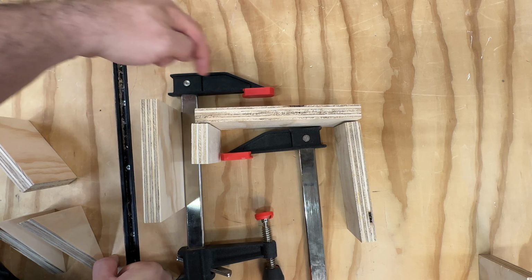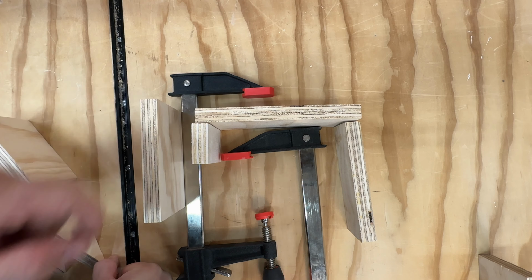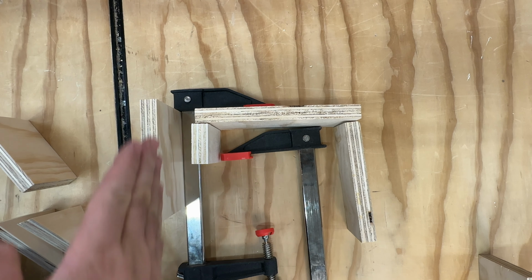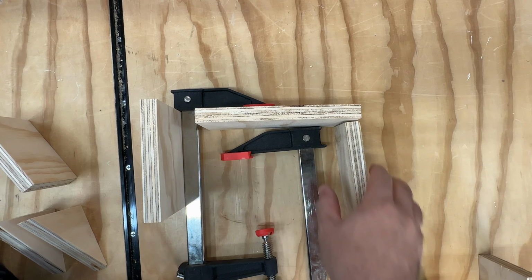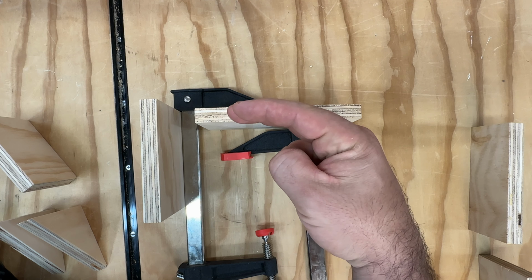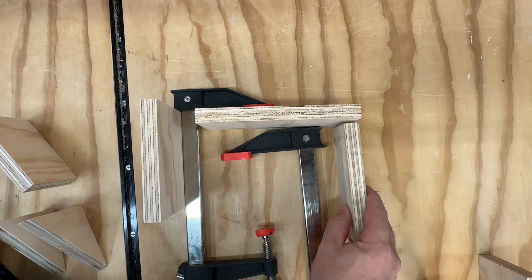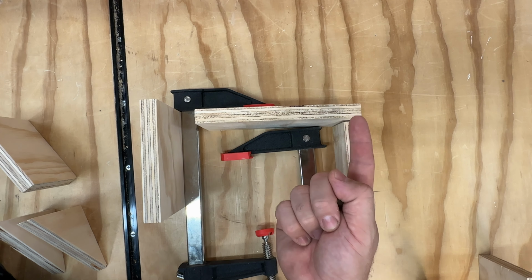Now the pad sits down further than this. So this piece of wood will be a quarter of an inch higher than this piece of wood when we attach it to the board so that the clamp will stay straight and it won't go cockeyed when it comes out of there. Now for this piece, if I just glued and screwed this horizontal piece, it would be fine if you did two or three clamps, but I plan on having, you know, maybe six clamps out. And so the more pressure you get further out, it will eventually cause this to break off. So you need to have some vertically spaced pieces that support it because this has a lot of force this way in gripping power to support this piece right here.